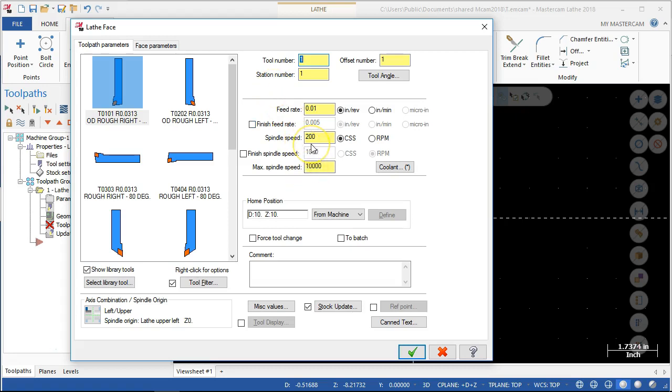With the constant surface speed, even in aluminum, that 4.5 by 6 inch chunk is going to be a 6, 7, or 8 pound chunk of metal whipping around. Even if I have 3,000 RPM available, I'm not going to let it run up to 3,000. On something that size, I'm going to probably limit it to maybe 1,600 RPM — see what the balance of the material is, see how the rigidity of the machine holds up, and then we can always bump that up a little bit. So the spindle speed at 200 constant surface speed: mainly at the outside you may be 300 or 400 RPM, but by the time it gets to the center it will max at whatever you tell it. Most medium-duty machines are going to max at 3,000 RPM. First run-through, I'm not comfortable watching a chunk that size spinning at 3,000 RPM.